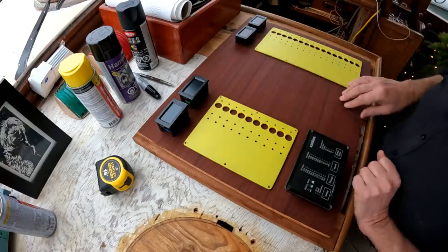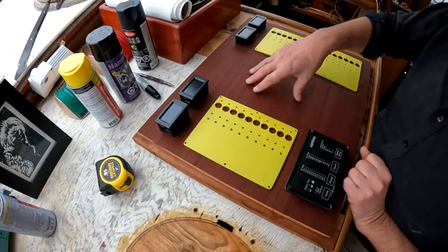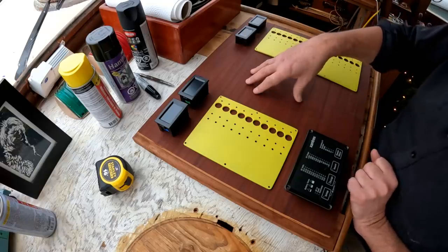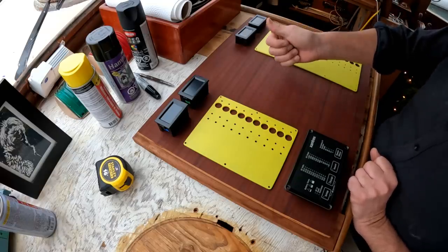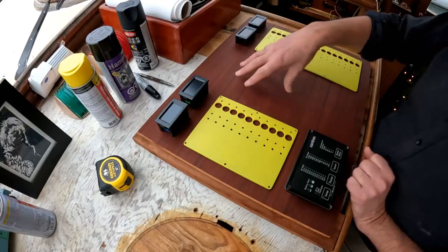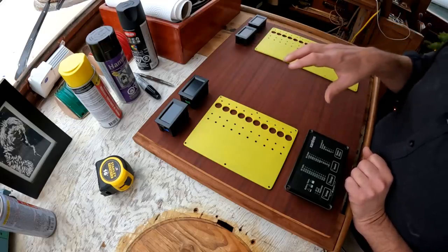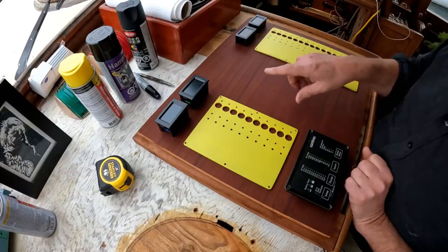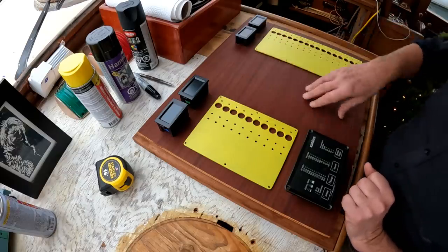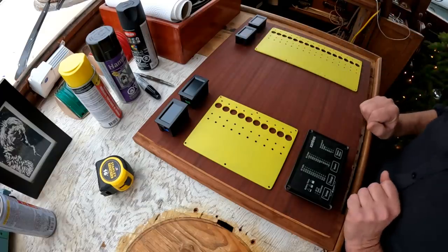And everything up in the middle will be the remainder of the things that I want to switch here. But keeping in mind that this is primarily a power distribution and information panel, many of the things are switched at the helm. But some things will be switched here. Blower controls, overrides for bilge pumps, things like that, timers for the blowers, as well as level gauges, not fuel, but water, gray water, and black water will all be here somewhere. And this is really yet to be fully developed, but I have a fair amount of real estate to do it.